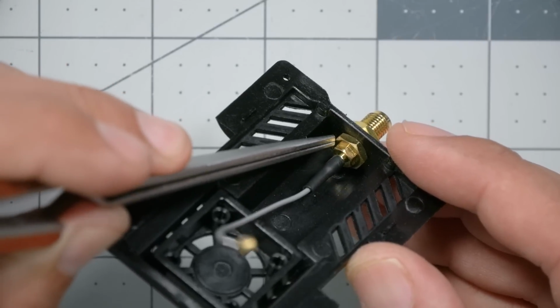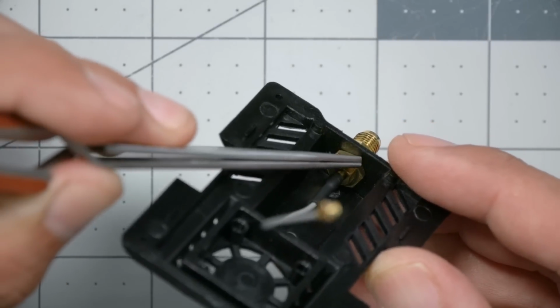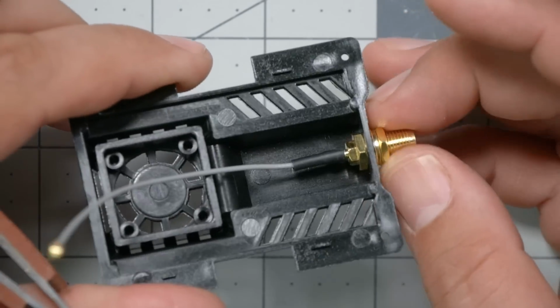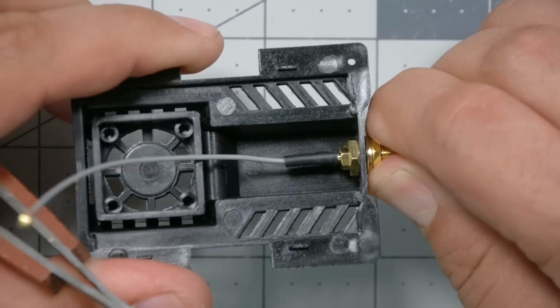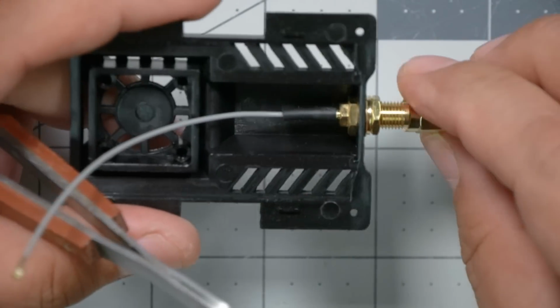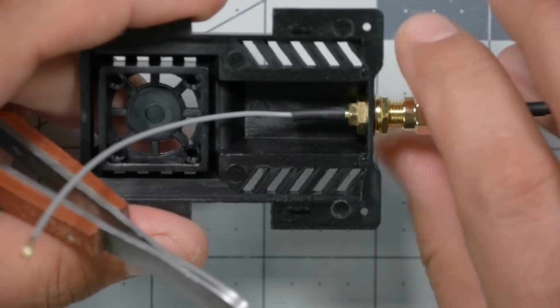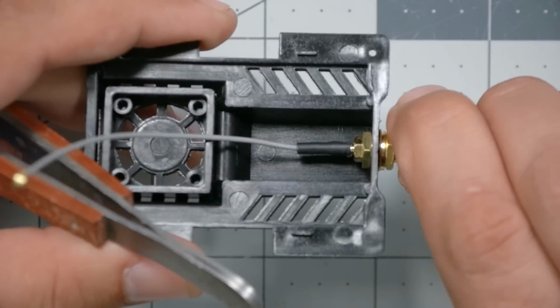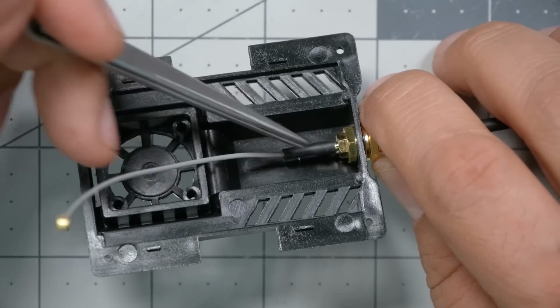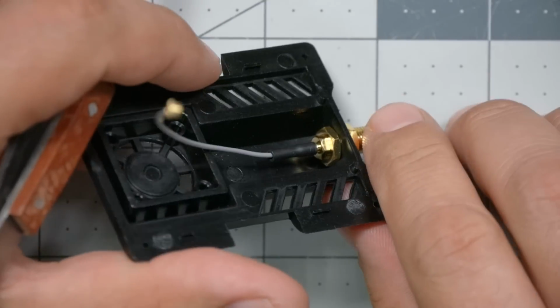It would be really nice if this mold had some kind of a cup here to help prevent this nut from spinning. The way it is now, if you crank down on your antenna and tighten your antenna, this will just twist. Well, it's fairly... Let's try it. If I crank down on my antenna... Oh, I've tightened it down enough, it's not twisting. If this loosens up, this can just twist and it'll break off this connector inside here. So, suggestion for a future design of this piece.